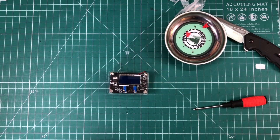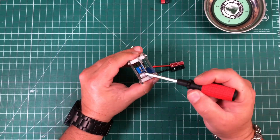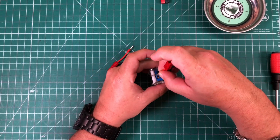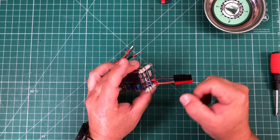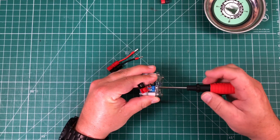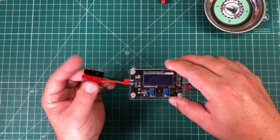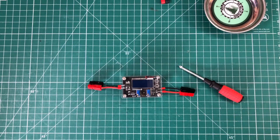Let's wire up some wires. I put ferrules on these jumper cables — I did have to crush them down because the connectors don't open up very wide, a little forceful persuasion. Insert them minding the plus and minus symbols, and tighten them down. Notice this side says 'in' — that's coming from our power supply — and this side is the output. Don't mix those up.